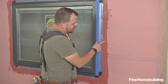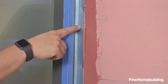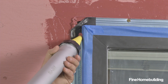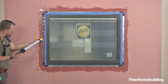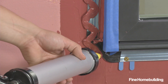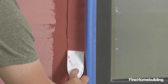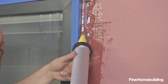In this instance, our liquid applied sealant is going to bridge from our wall to the jamb of our window, and it has to go across our flange and that flange-to-jamb connection. So I'm going to take this opportunity to mask it off just to protect the window. Now we're ready to apply our final bead of sealant. This product is actually the Fast Flash product — they also make a joint and seam product that's for larger gaps. It's good to keep in mind that while we're working with this sealant, we're just looking for continuous coverage.